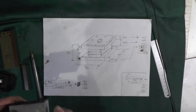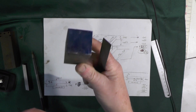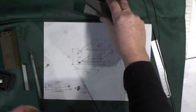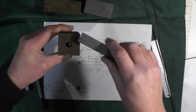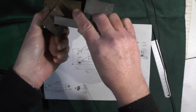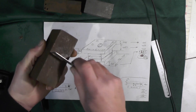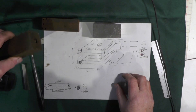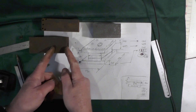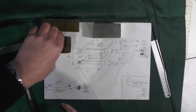I've had a rummage round my stash. I've got a piece of good quality aluminium here that's just under inch and a half, so I could get it out of that. Then I've got this piece of steel which has already got a half inch hole in it — it's a fraction over inch and a half. I'll use this piece of steel and reduce that hole size down.